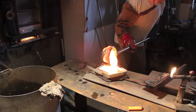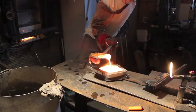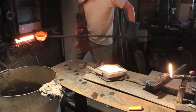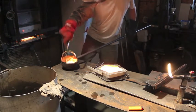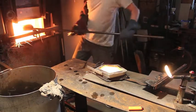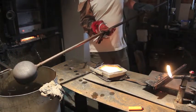I'm careful not to overlap because that'll trap a big air bubble. I go back and forth a few times to get a very thin stringer and then pull it off. I lift off the two areas that usually stick to the ladle, then put the glass back in the furnace and put the ladle back in the water.